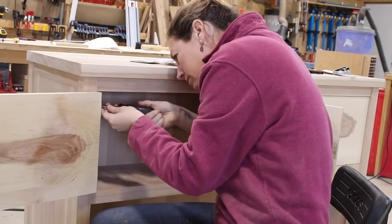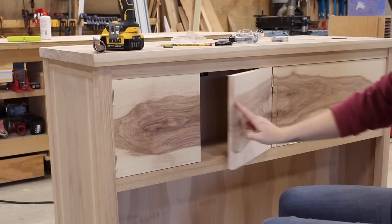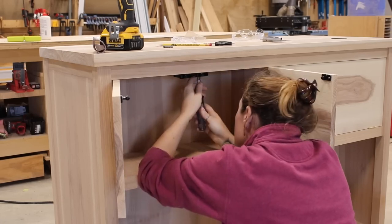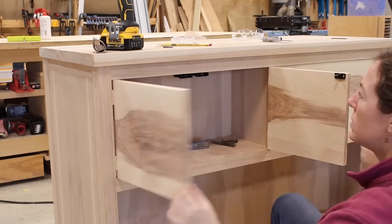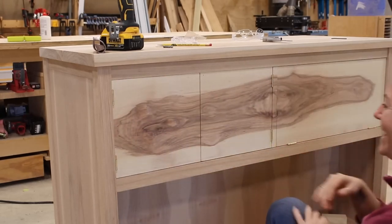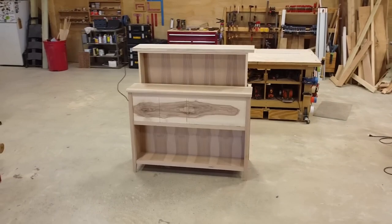I love this mechanism because it means I don't need to clutter the front with a drawer pull — just a simple push of a finger will open or close the door. I could have done another drop door on the left, but for fun, let's change it up to two swing doors. These hinges are mounted on the sides instead of the bottom, then more math to get the push-to-open hardware mounted properly. That one was too far back, but this hardware is simple to adjust. Since the left was correct, I used a combination square to get the right one set to the same depth. To see this cabinet complete and working so fabulously — I had this idea for about two years — I was on cloud nine.